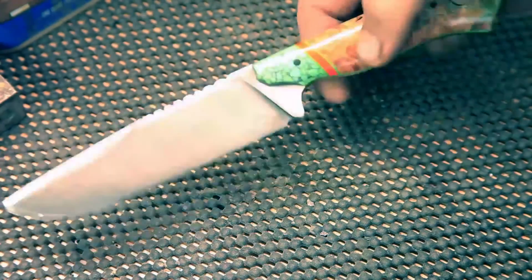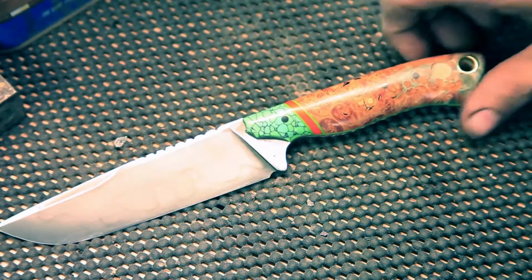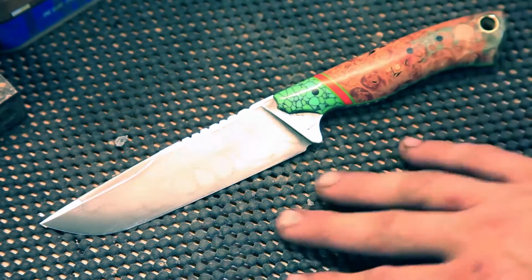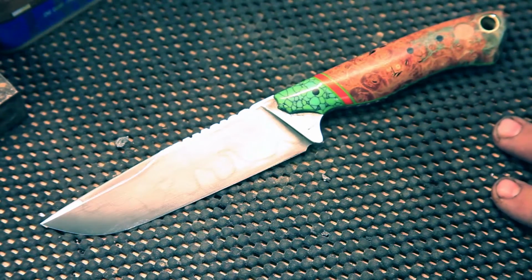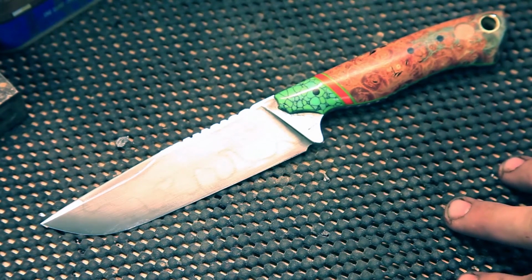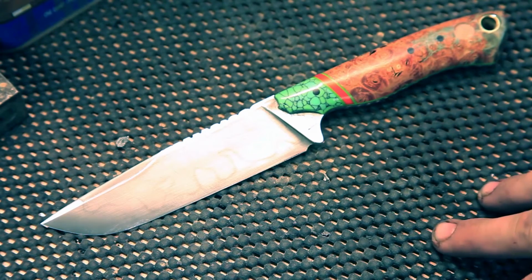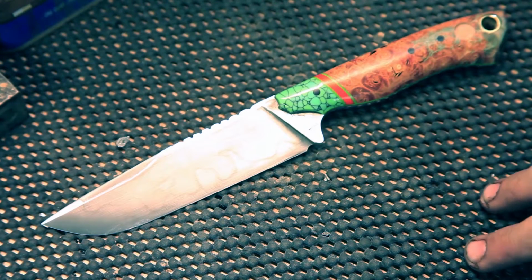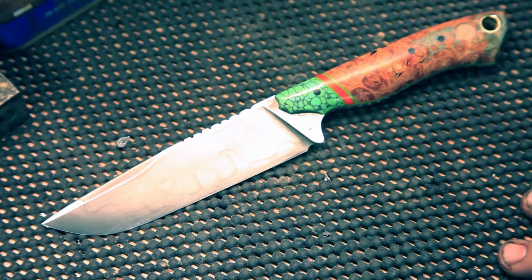We're at an 800 grit finish right now, and you can see it's already really glossy. I will just pass this over the buffer a few times real lightly, and I'm going to use a white buffing wheel with white compound. And the reason for that is the yellow ones work really well on metal. I think those are linen and the white ones are cotton.